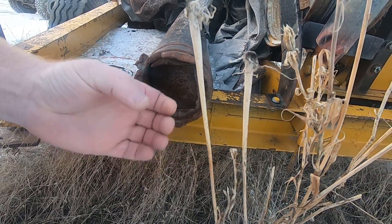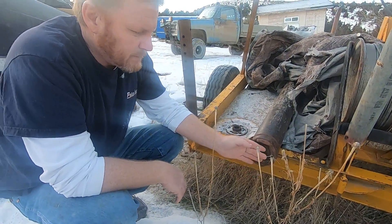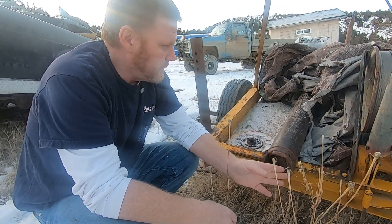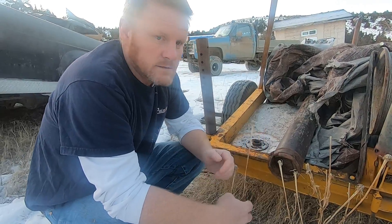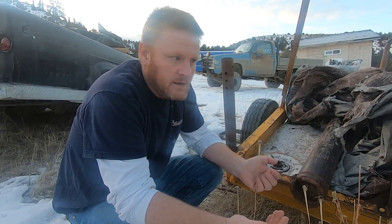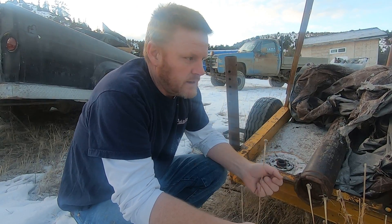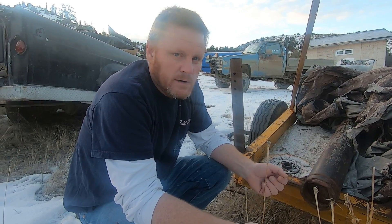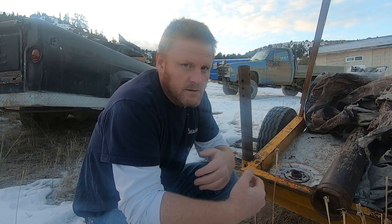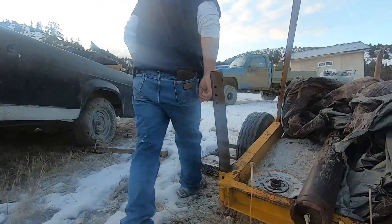It was like it was under suction. If I had to do it over again, I would swap this metal flapper out with a rubber flapper — that way if it ever gets stuck due to suction, the rubber flapper would pull through. That's something I learned. We never knew anything about drilling wells; we just built this thing and did some research on cable tool drilling, but there's no substitute for experience. I drilled one successful well, tried drilling about three others, and all of them were disasters — I lost all my tooling except for just a few things here. This was a driver bit.